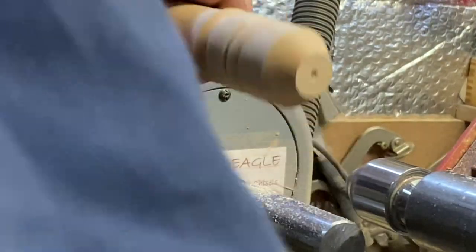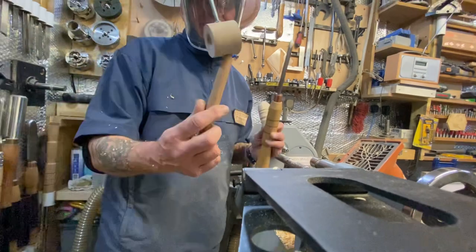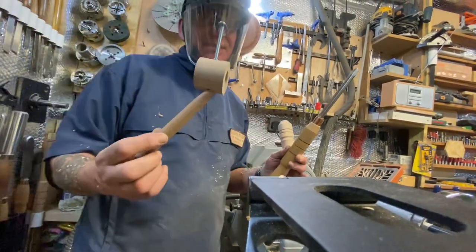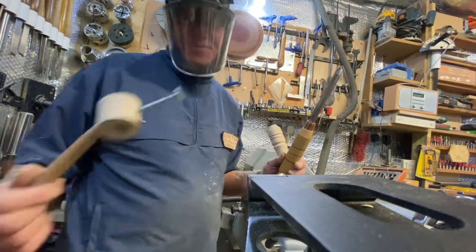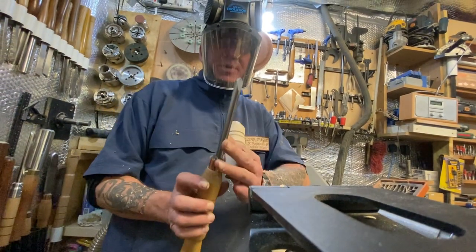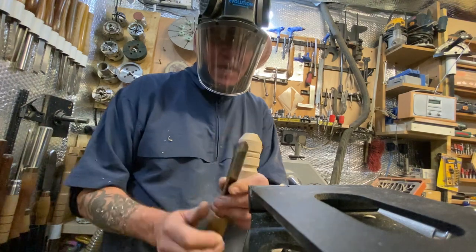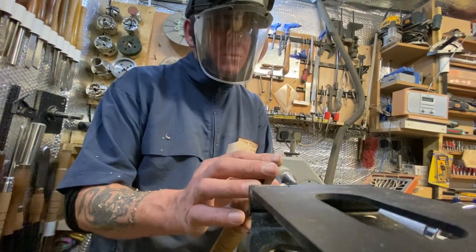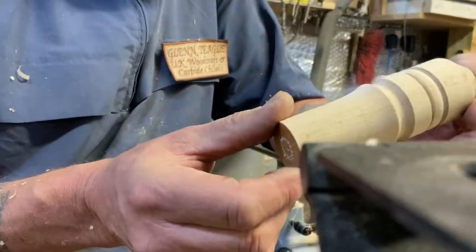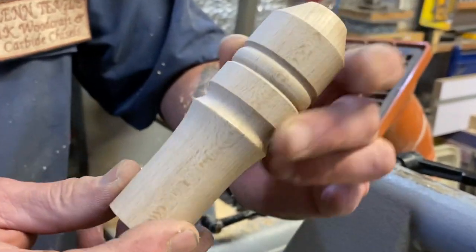Right, now what I want you to see, guys, now you see how I sharpened that with this, okay? That didn't cost £239. Right, you got to remember what this is. That sharpened this chisel, put a different angle on it, okay? Even put relief, and that is super smooth, and oh, that is very sharp. And that's the finish we got straight off our tool. Okay, you can see I've just done that with that tool. That's the finish we've got.